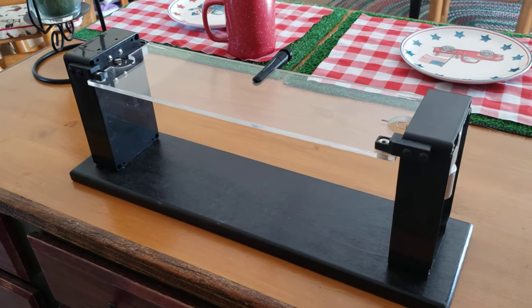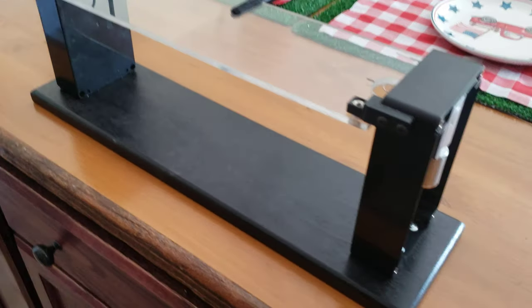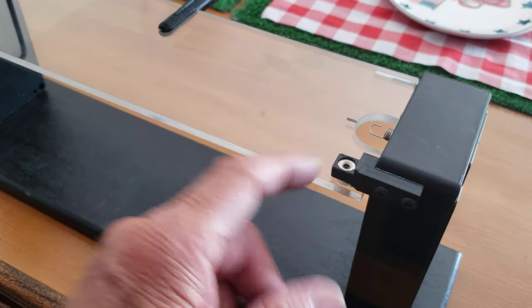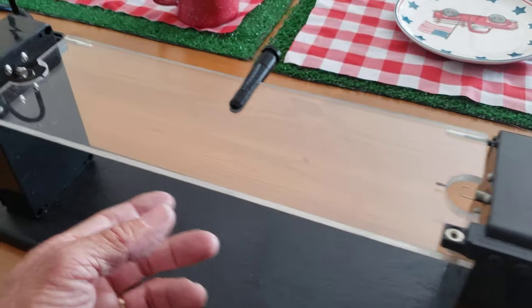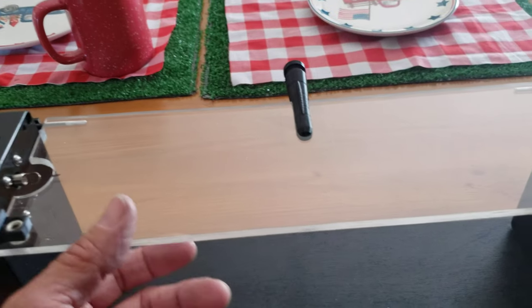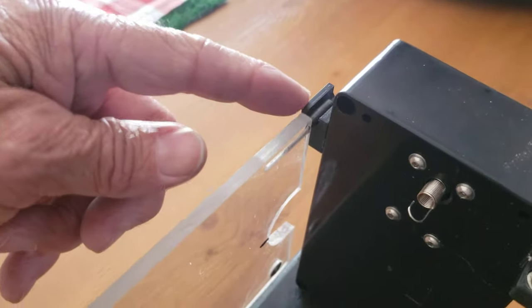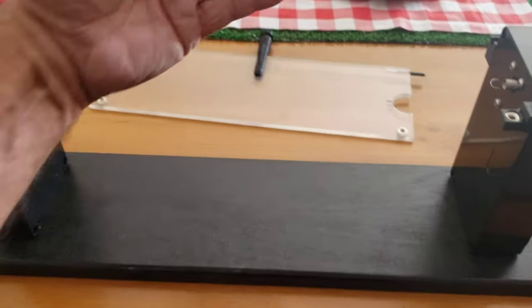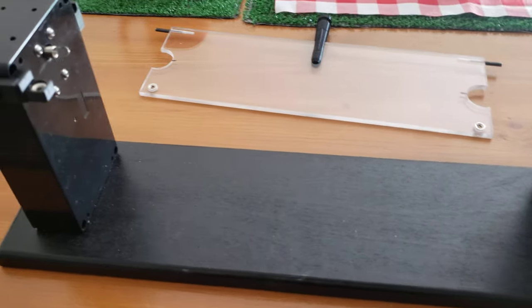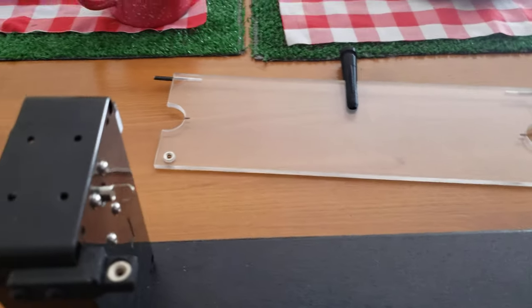Here's the new brush making table. It's not completed yet, but I'll give you an idea of what I've been working on — these magnetic latches. There's a reason for all of this. The magnetic latch allows me to have these pivot blocks that I made back here, so I can take and remove the table completely and then I've got complete free movement for whatever materials I'm using. If they're large materials, there's nothing for it to hit.